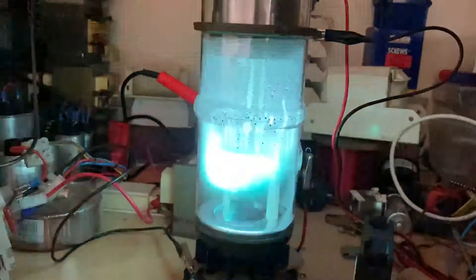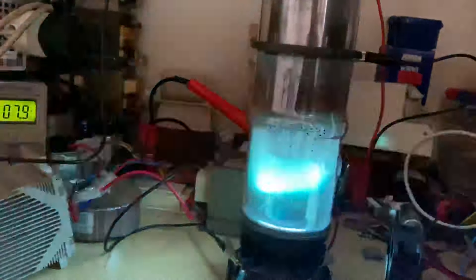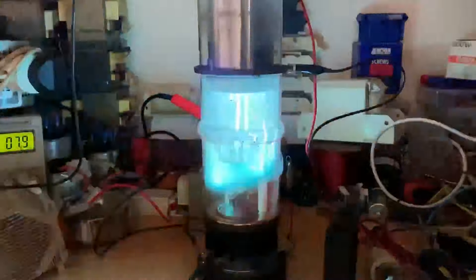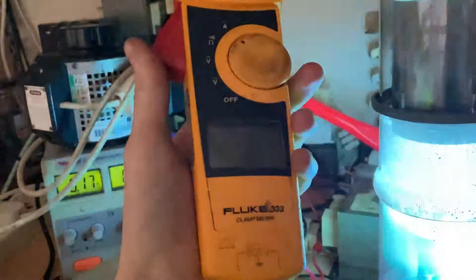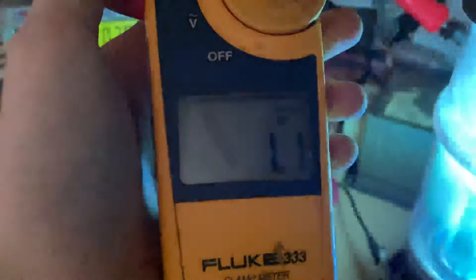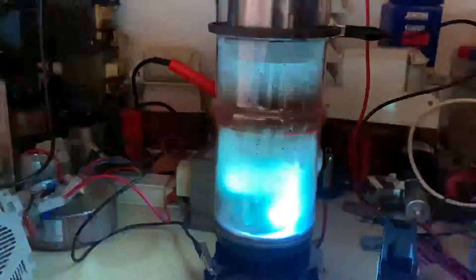It's quite interesting to see what's actually going through that. Let's hit the meter and measure the current. Let's just whack it right up and then we'll turn that on to amps. The meter wasn't working for a second but it's fine now. About an amp going through that roughly — so not all that much really. But this is capable of taking like 60 amps for a short period and about 10 amps continuous.